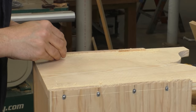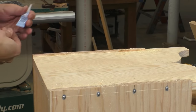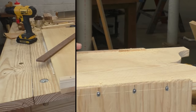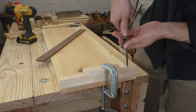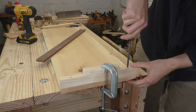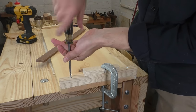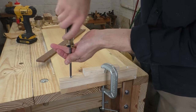If you've got a few tiny gaps in your joinery, throw in a little superglue and sawdust to close them up. You only want to use a tiny bit here because of that cross-grain construction — you can get away with a little glue as filler, but not much. Now we're coming down to the finish, and the last big part is the top. You can see I'm screwing battens to either end — those are going to keep the top from cupping when summer gets here, but they can't be glued on because they're also cross-grain. So I'm using screws, and I've taken a little round file and widened out the screw holes a bit.